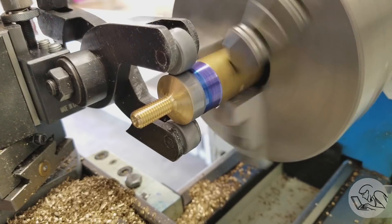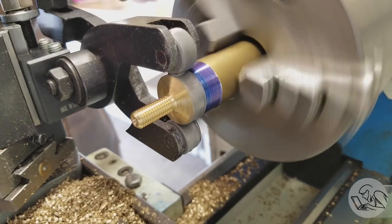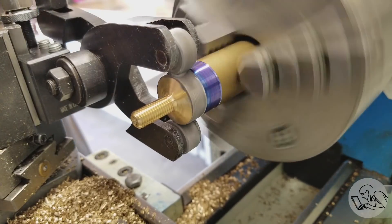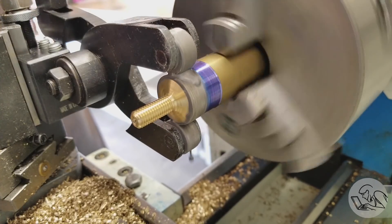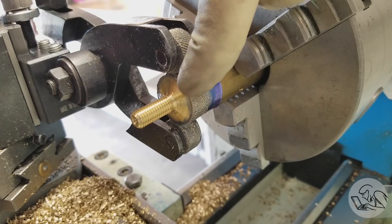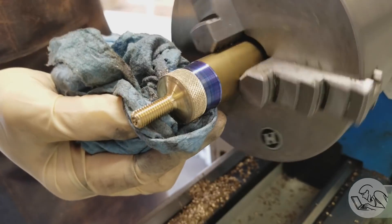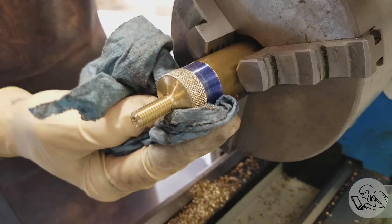And away we go — I'm using lots of cutting fluid, fairly low spindle RPM, and I just clamp it down until it feels about right. This is kind of a practice thing — you can stop and check if the knurl feels good. You're just waiting for the points to close up on those little diamonds. I think that's got it, so now we can loosen this and pull it away, then just clean up the crud. That's not too shabby.